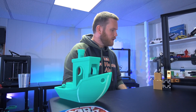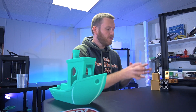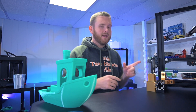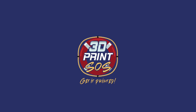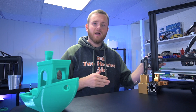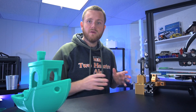But I did notice an issue underneath the printer right here on the right side of the machine. I noticed some dust underneath where this tensioner is that tensions the belt on the X axis. Something is a little bit off here that I didn't notice. So I went ahead and checked it against my other machines and 3 of my 8 machines had the same exact problem. What's happening is the tensioners aren't set up exactly straight, and the belt is actually rubbing up against one of the sides of the extrusions, causing it to get frayed on the edges and dust developing underneath the printers.